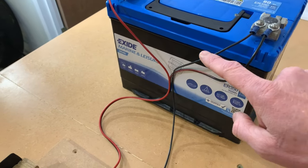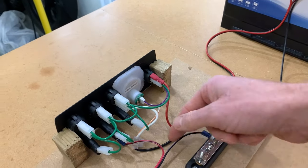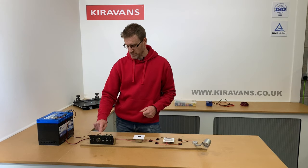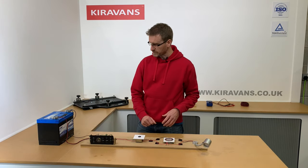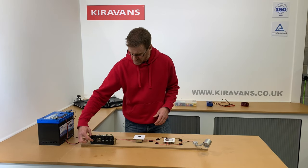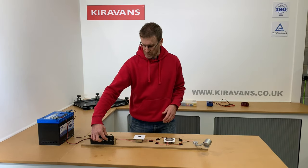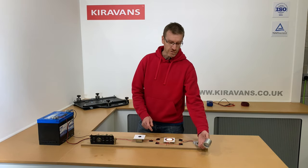There is one other from the negative port which comes into the negative wire on our distribution panel. So you can see how that connects the whole circuit together — as long as you've got power in your battery, you turn it on at the master switch, click on your circuit that you want on, any switches you want on, and you're good to go.